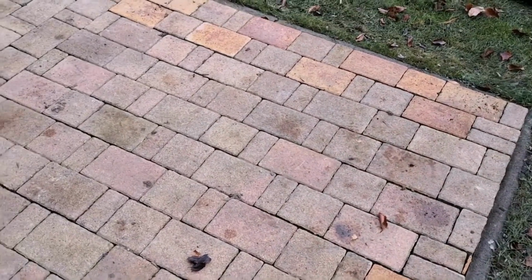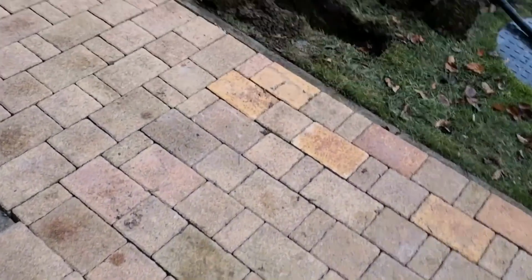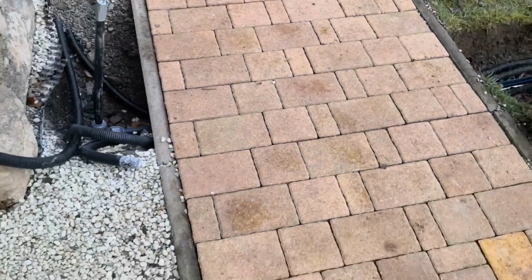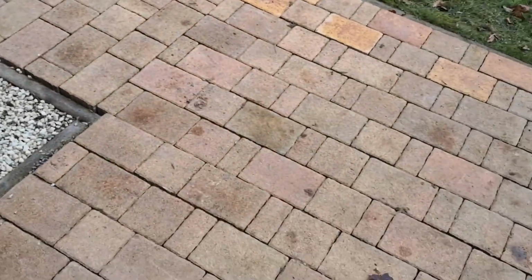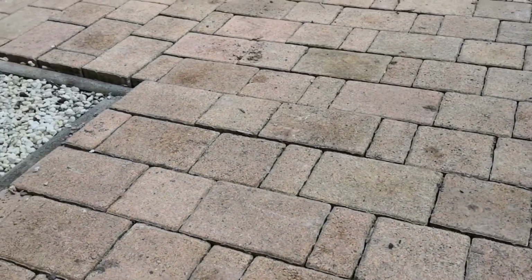The vibrating plate is now introduced into the process. This important step ensures that all materials are compacted thoroughly and evenly. The vibration helps settle particles, remove air gaps, and create a stable foundation, which is crucial for the structure's integrity and durability. Then these edges will also disappear. These are the approximately 2 centimeter height offsets that I have personally installed.